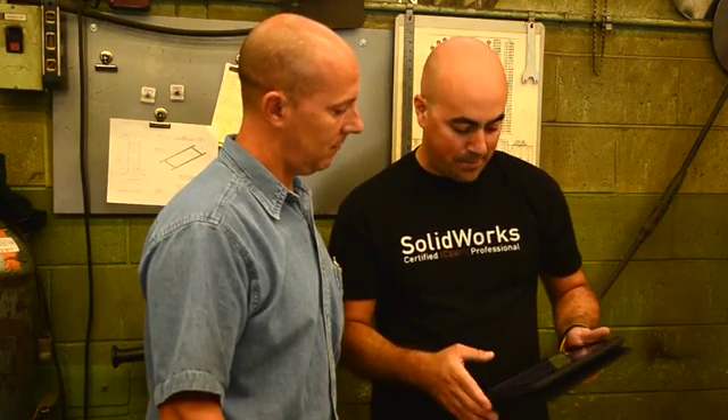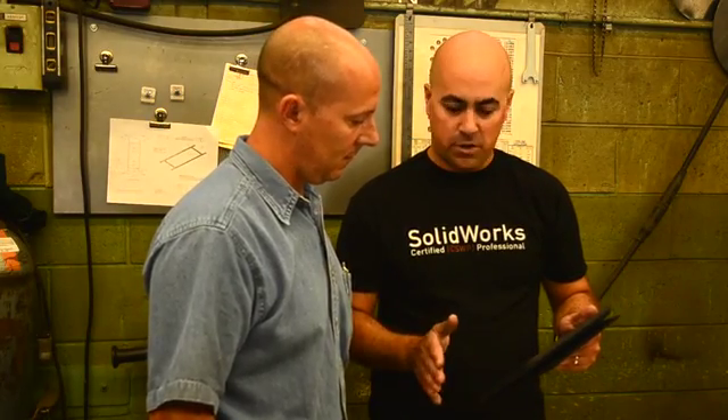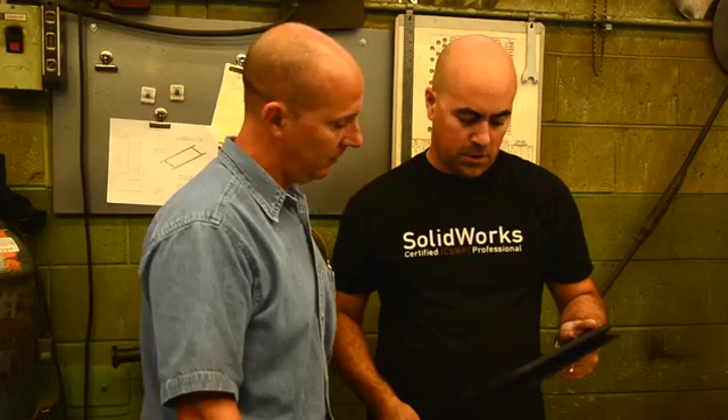Looking at the driving position, the goal is a cool setup — like you're on a jet ski, one foot forward and one foot back. The main concern is avoiding a chassis that looks too boxy. The design has a lot of straight lines to make it fast to manufacture, but the plan is to add some curves. Jeff advises that with SOLIDWORKS, you can easily smooth those out and add some radii — their shop can handle it. You can either bend one long piece or buy pre-bent tubes, and you don't even have to go rectangular — you can use round tube.